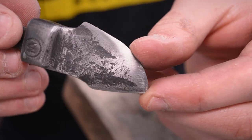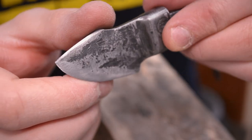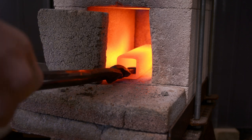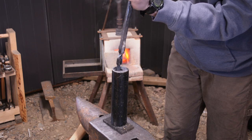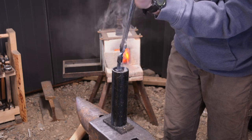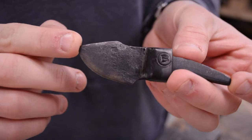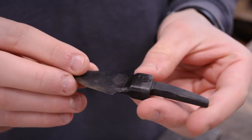For this knife I'm going to leave the blade with a pretty rough finish — I think it looks pretty cool with all the scale and the patina from the forge. To heat treat this knife I place it in a pipe in my forge because it keeps a more even heat than the forge's flames. To quench it I'm using canola oil that I probably should have preheated — preheating the oil can help the blade cool off faster because it's less viscous. I did a quick file test and thankfully it hardened despite my forgetfulness. After I quenched the blade I put it back in the forge to temper it, and once I got it to the tempering colors that I wanted I dunked it back in the oil to cool it off. That's why it has this nice dark finish, and I think I'm actually going to leave it like that.